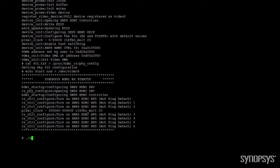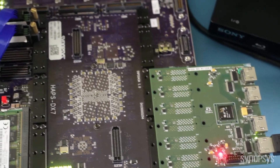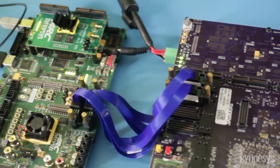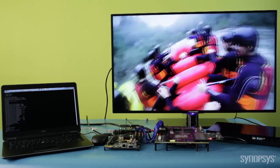The ARC-PGU application directs the video DMA to be written into the ARC processor graphic unit buffers. This example illustrates the video image received from the PHY, processed by the controller, sent to the ARC software development platform, and finally sent to the HDMI output and the TV.